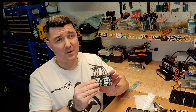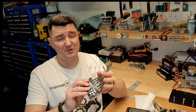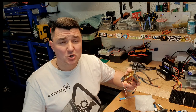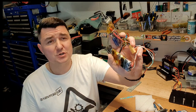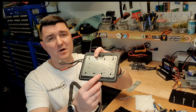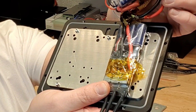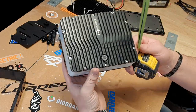And if you haven't heard about the new Trampa dual VESC HD60, very soon — a couple of weeks' time — we'll fully review this unit. Yes, that is the dual VESC by Trampa, the original. At the same time, for all ESCs or VESCs that have a body with threads, you can also install ESCs that don't have the aluminium casing. That's why there are larger holes where you can thread through a zip tie and fix the ESC down to the plate, allowing it to cool and stay fixed.